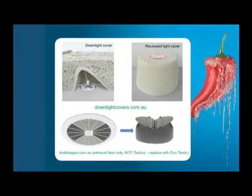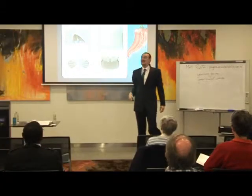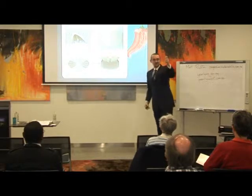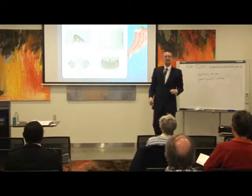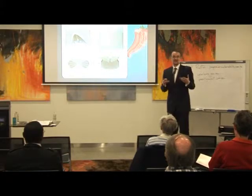The first thing I want to explain is downlights and recessed lights. We don't have any downlights in this room, but most downlights are just flush with the ceiling. Recessed lights are lights that go up into the ceiling — they're sort of a dome and you can generally put an old-school 240-volt globe up into the dome. Downlights don't seal very well, so they'll often act like chimneys and actively suck warm air out of your house.